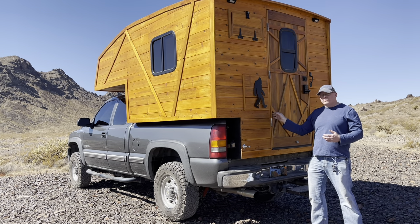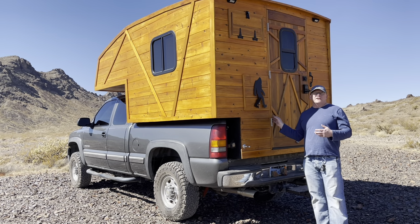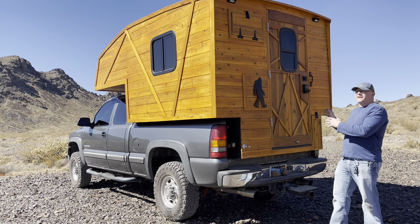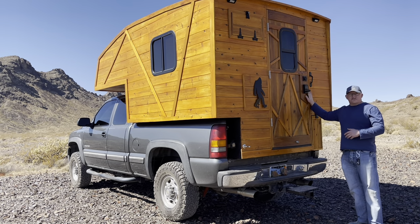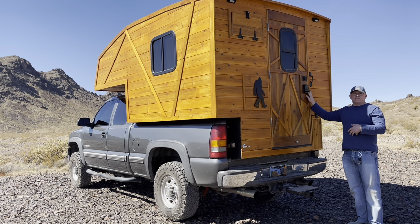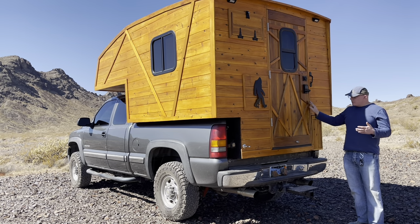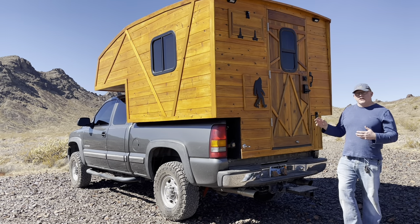The header, footer, and frame around the door were also made out of oak. Oak is heavy, but I chose it because I wanted additional strength — both structurally and from a security standpoint around the door. For example, the lock set sits in oak. If this had all been cedar it would have still been functional, but it wouldn't have the strength to hold up to break-in attempts. That's one example of where I used an alternate building material in a very specific application.